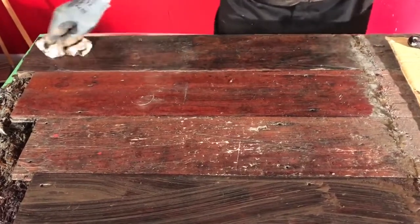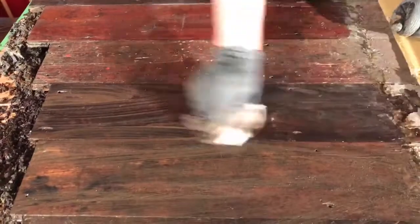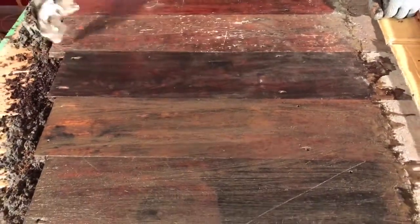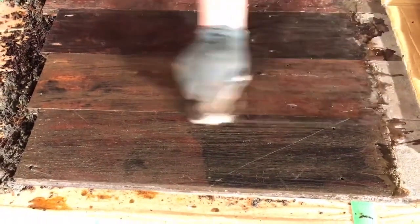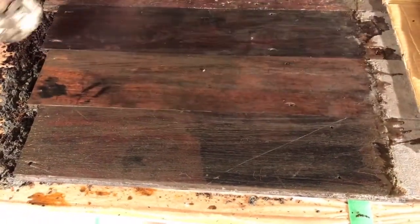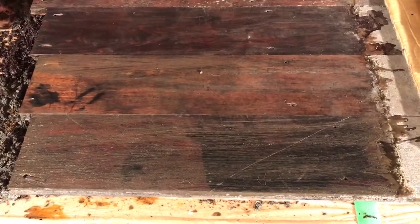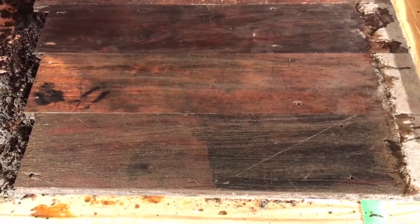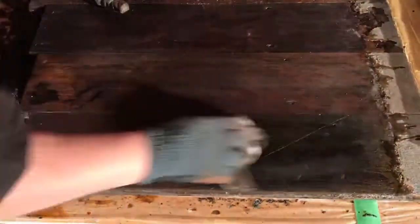Just wipe any that's soft, then you might as well take it off. You'll use less rinse, the flusher, later. The reason we use a paraffin-based flusher is it takes longer to dry than lacquer thinners or meths, and also it doesn't stink. The paraffin-based rinser you used has got a sort of candle-type smell, so it's quite pleasant to work with.